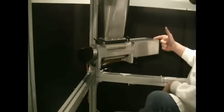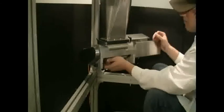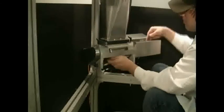Open the cover to the scalpel connecting bar. Inside, lift the shaft holding pin and turn it so as to disengage it from the shaft. Grab a hold of the drum and slide it to the right. While still holding the drum, lift the connecting bar off of the key that holds the scalpel in position. Here, the same action is shown from a different angle.